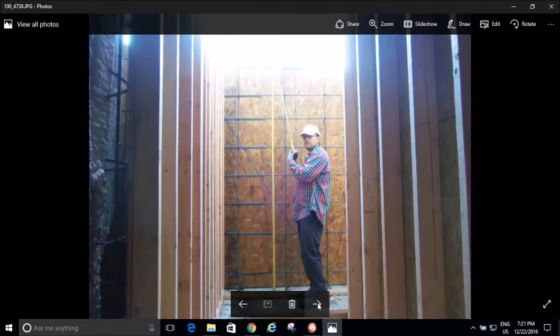Just wanted to show that I got her all tied up before I put that other form on. Look at my studs. This is insane. I'm probably 8 inches on center with my studs. 3/4 plywood. I knew the concrete was going to exert a tremendous amount of force, and so I just did everything I could to make it strong so it wouldn't bow the forms out.